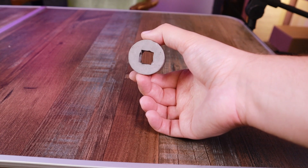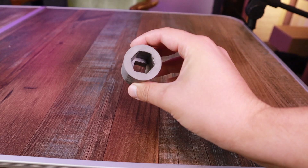So I can't seem to break this one — not with this test anyway. I'll have to come up with some new tests to really push it to its limits. I think the impact wrench was the only thing able to do any damage — you can see a little bit of deformation around where the impact wrench went in, and there's also some slight indents on the lug nut side. It did way better than both the PEEK and nylon carbon fiber ones, which is no surprise at all since this one's metal and those are plastic. So would I recommend using a 3D printed one over a store-bought one? No. But it does demonstrate the strength of 3D printing. If you've designed something that needs to be really strong but can't be made from traditional CNC machining, consider using 3D printed aluminum — it definitely has its uses, but this was just for a fun test.